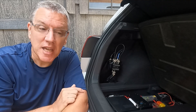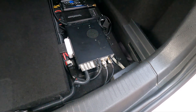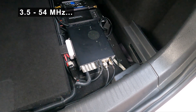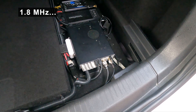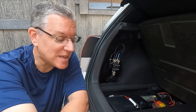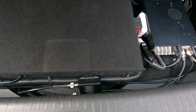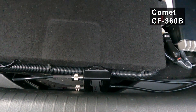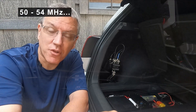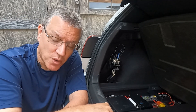Starting with the 857D and its HF output: the HF output covers six meters through 80 meters — really down to 160 meters, but I don't have an antenna for that, so I call it 10 and 6 to 80. The HF output leaves that port and comes to a Comet CF-360B diplexer, which separates the six meter signal from the other bands. Ten meters through 80 meters continues through the trunk floor.